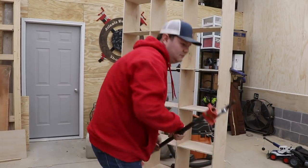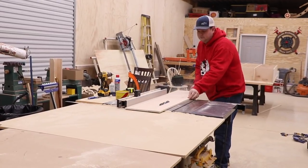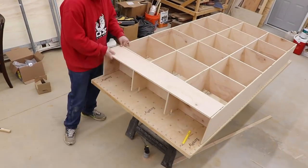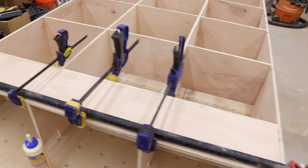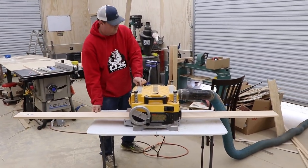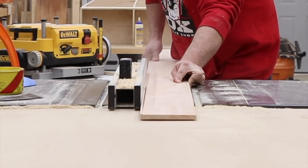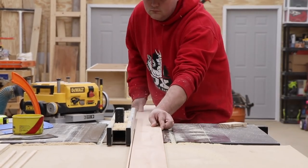I leave it clamped up for a day, take the clamps off, and now I'm going to rip the plywood down on the table saw and cut it to final length on the miter saw for the cap on the bottom. I use brads and wood glue to secure it and clamp it for a while. While that's drying, I take some pine that we bought, plane it down to a half inch in thickness to match the plywood, and cut it down into strips to cover all the ply on the front of the shelf — it makes it look a whole lot better and it's harder to tell it's plywood.